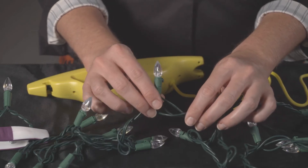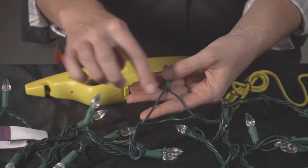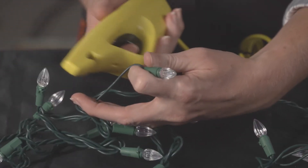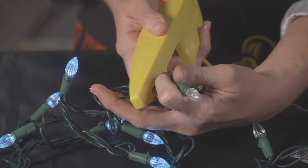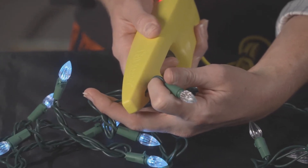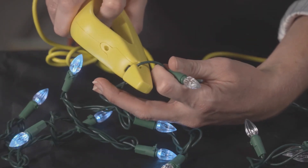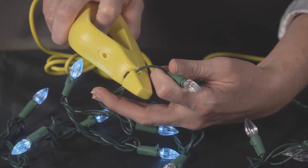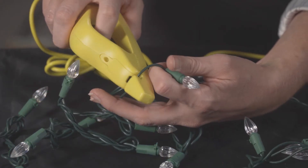We will start testing at about the halfway point in the non-working section. Pick a bulb in this area. We will be concentrating on the wire either going into or out of that bulb. If we use the other wires on the light set, it would not harm the light set, the tool, or the user, but the testing simply won't work. Place the wire within the black hook at the tip of the LED Keeper. The LED Keeper's pin must make a solid connection with the copper inside the light set's wire insulation. You might prefer to flip the tool for testing so you can easily see the wire placement. Once the wire is seated within the black hook, firmly pull the trigger to illuminate the functional section.